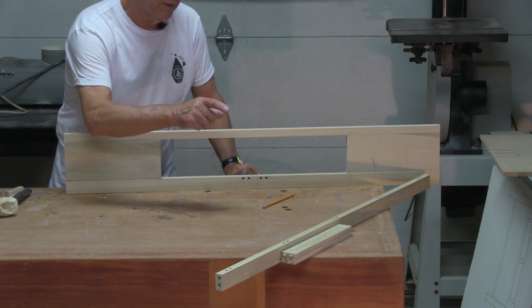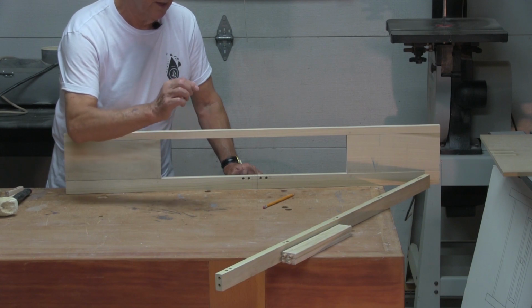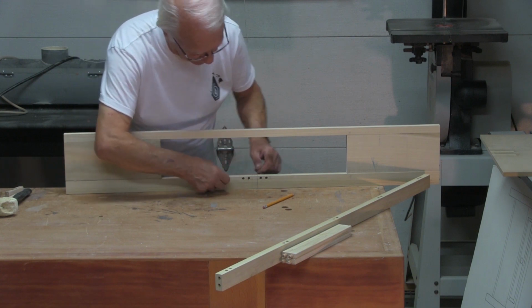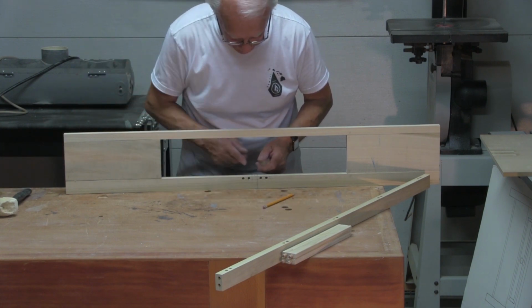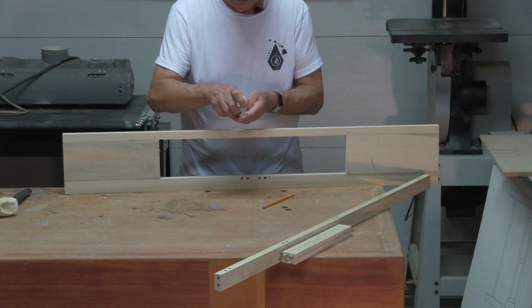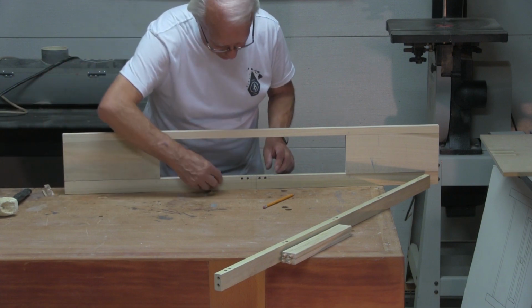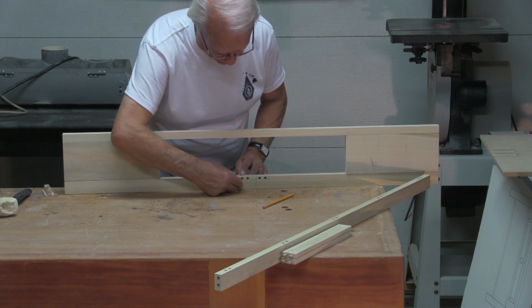center on the 1/2 inch slides. 1/2 inch, half that is 1/4 inch, minus 3/8 is minus 1/8. So we have to reduce the span of Dowelmax by 1/8 of an inch, and then we clamp it on here. First of all, we find our center, on both the rear rail and the front rail. Draw a line. Move out. This is 9/16 in width, so we move out 9/32 and 9/32 at each side, and then we align the Dowelmax with the line here, and using the 1/8 of an inch spacer, we drill in 2 5/16 dowels.